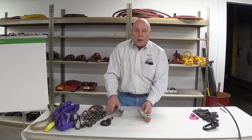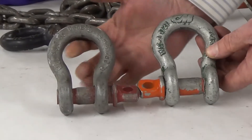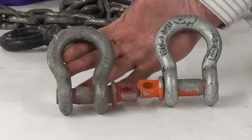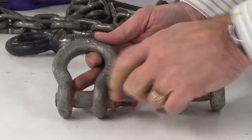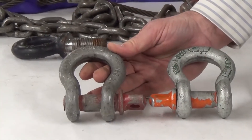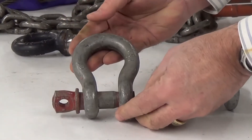I'll show another shackle by comparison — we can see significant damage here, with side loading or yielding of that ear. The shoulder is not nearly to the ear on the pin-to-ear contact, but it's certainly coming out on the other side. We have clear deformation of this shackle.